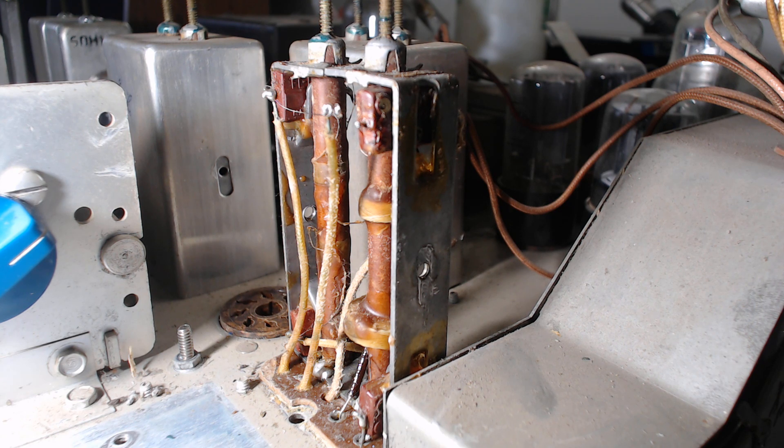To test and replace, I heat the first capacitor with the soldering iron, then get behind it with tweezers and apply pressure to rotate it off. There are two wires with loops that have been wrapped around the capacitor posts — they're very easy to break, so be careful. I suck the solder off the connection, push a tapered pin through the loop, heat it, and then place the same loops over the new capacitor. Don't try to undo and straighten those loops — they'll fall apart. Be very gentle.